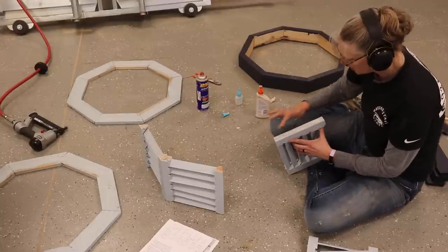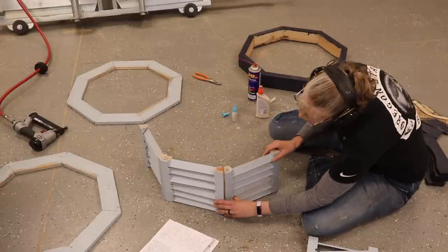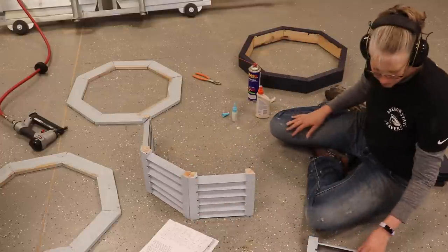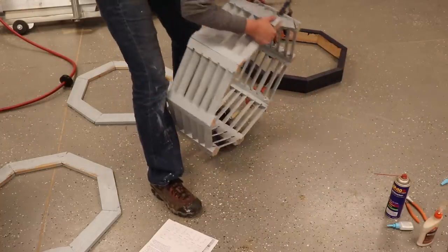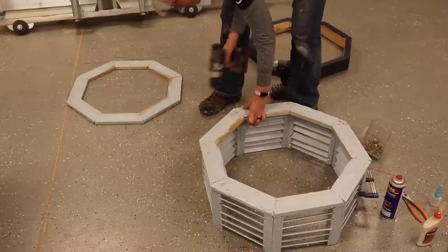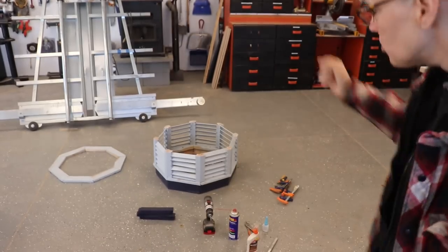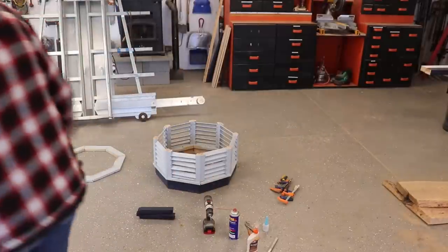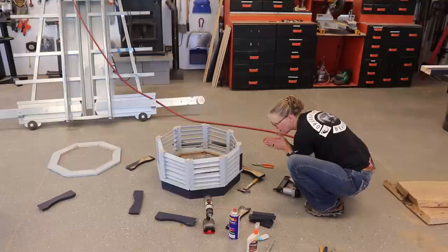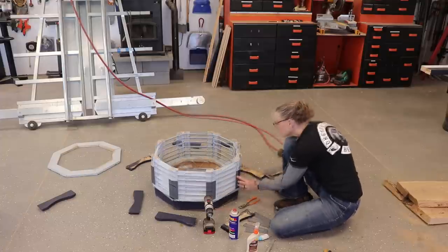I was very excited about assembling the whole entire thing. First I put together the louver ring, using wood glue and also CA glue with the 2P10 activator just so I could get these strange angles to adhere quickly. Then I attached the ring that connects to the louver ring, and then attached those to the thicker ring. Then I put on those extra boards I made — I'm so glad I made these, because they covered the visible cuts where the louvers slide in and also those mistake cuts, and they added a nice color contrast too.